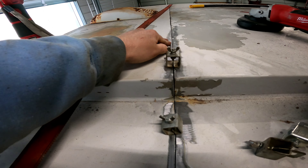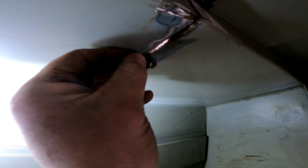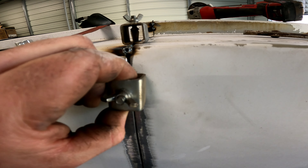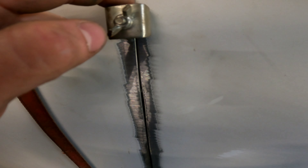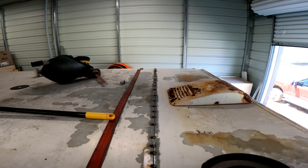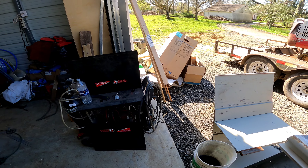I started tacking the top. I dropped these welding clamps into the hole and slid them in — perfectly flush. The best part about these is as you tack behind that ugly tack you can slide them down as you go, then tack behind it and keep sliding, so you only really need one. We're tacked all the way across now. Time to do the bottom.